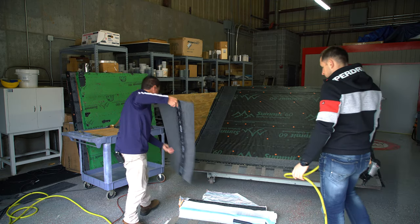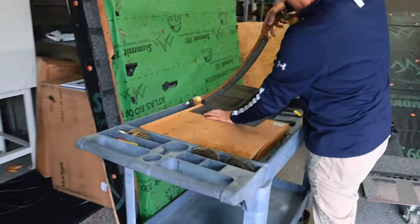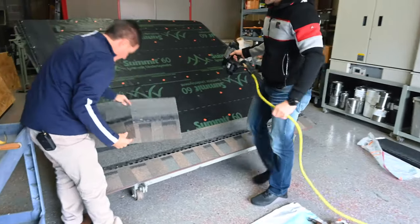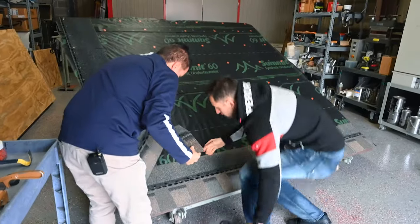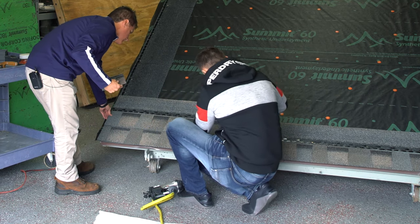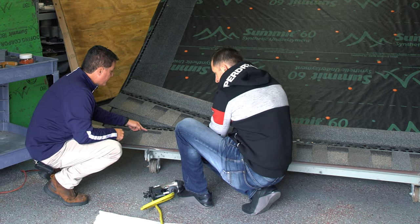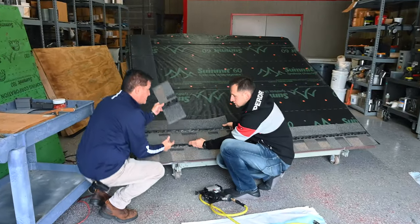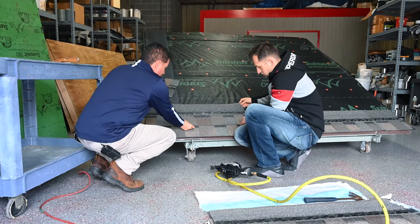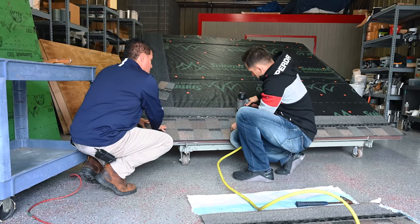So we're going to do the six-inch offset and save the pieces we cut. Here's your first piece - we just took six inches off. Go ahead and install it. This is your exposure, so you want to be right on this edge here. Now you have your six-inch offset. Save this piece rather than throwing it away. Install it flush, come all the way down to your exposure line. Now you have a true six-inch exposure on your shingle - four nails at 130, or six nails if required by code.